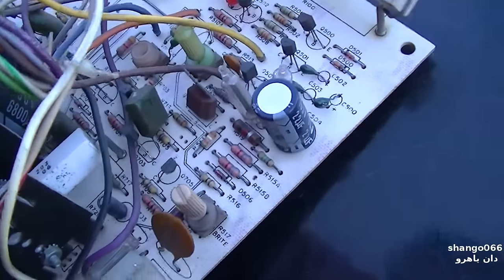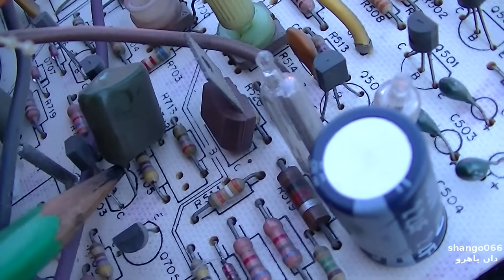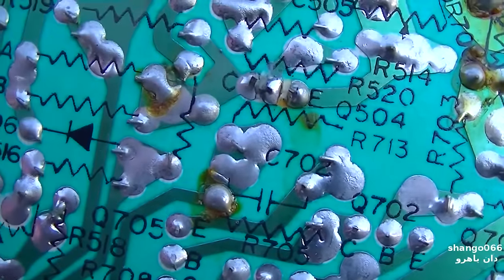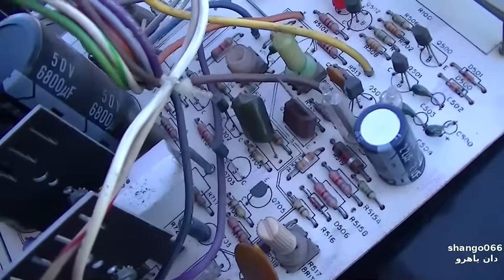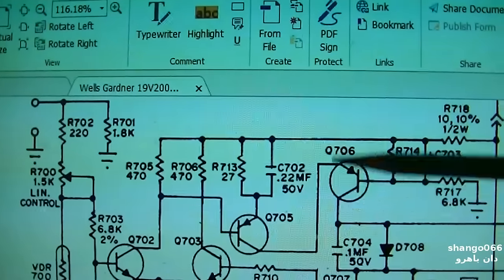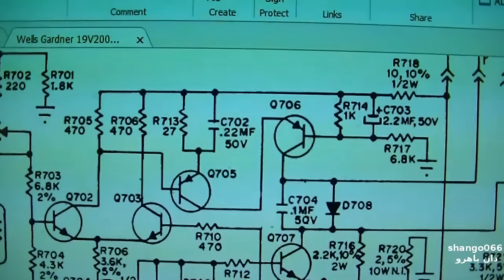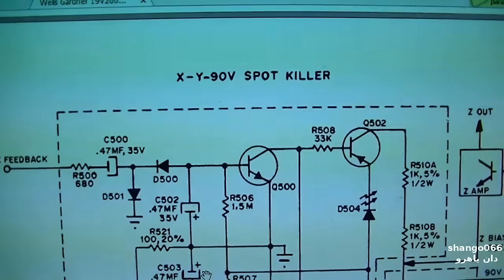This time it worked but I had an incredibly bright dot right in the middle and it almost looks like there's some screen burn there, so I'm not going to continue with that. I started reading about the spot killer circuit. I was looking at this with a magnifying glass - these are tantalum capacitors - but then I noticed this capacitor here is not even soldered in. If you look at the bottom of it, it's totally smooth like it never was soldered in from the factory. That's C702 on the X channel.